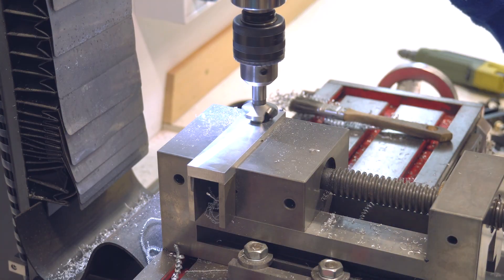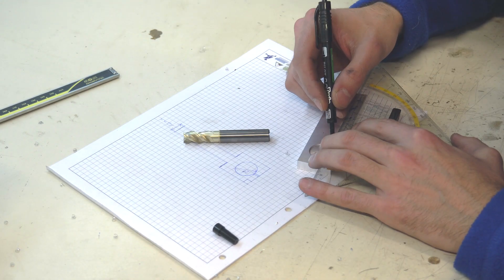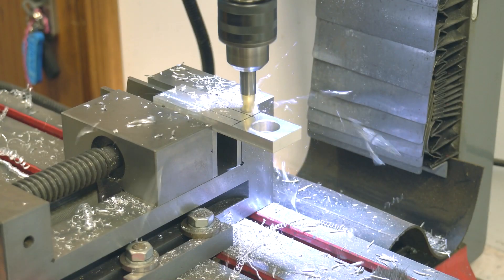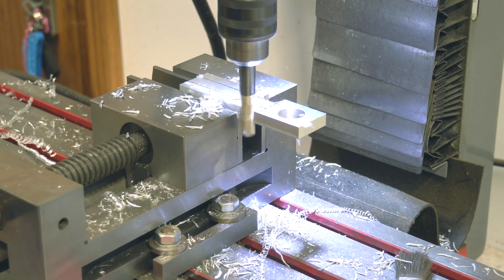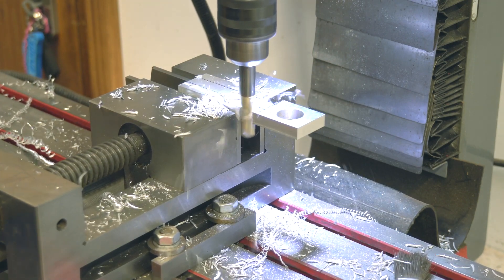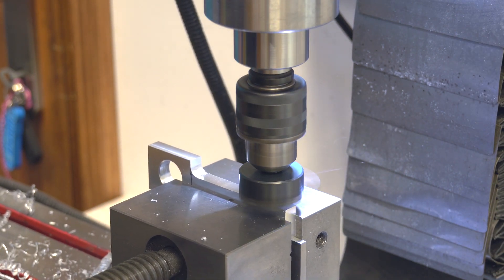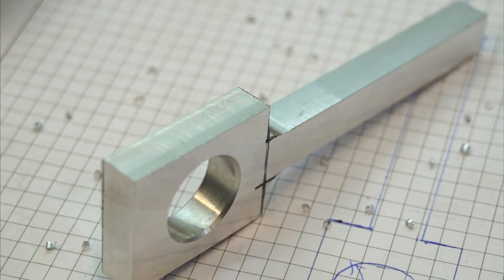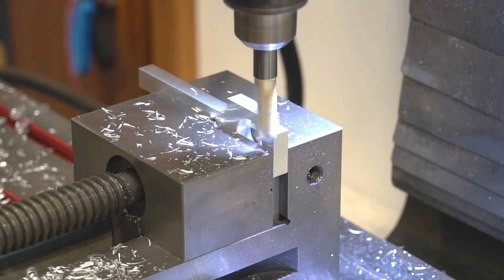So I can cut the edges. The dimension of that part doesn't matter so much, so I mark the lines onto the piece and just follow them while milling. This part is really easy to make, so I improvise a bit and make a radius here instead of a right angle as I drew in the sketches. Then again use the fly cutter to make a straight shank to clamp in the lathe tool holder. So the part looks something like this.